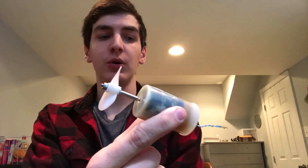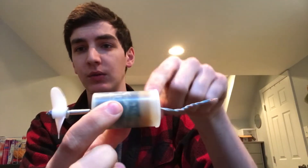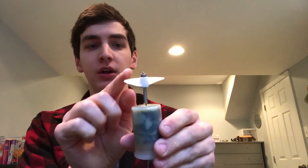Here's a look at the motor. It's just a DC brushless motor that runs off of 12 volts. To waterproof it, we just wrapped it in electrical tape, then waxed it and put it in a film canister. And this is just a set of underwater propellers.